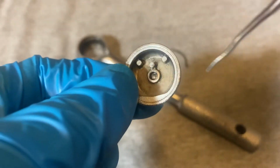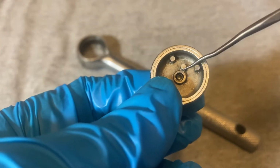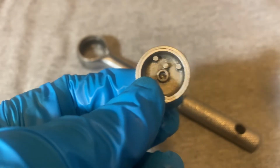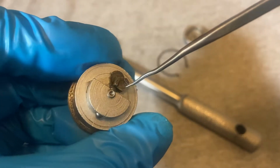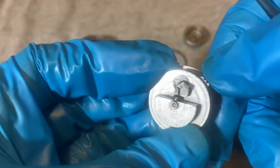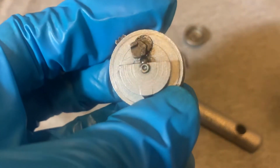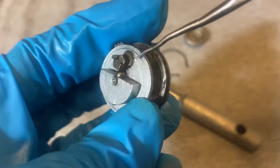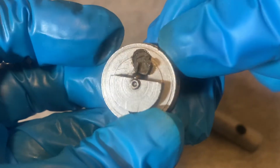There's a hole here in the middle of the switch where the protrusion fits. And here, this is what engages the pawl, the post switch combination right here. That little protrusion fits in there, and when you switch the switch from side to side, it rocks the switch from side to side, and the ball bearing underneath the little post switch keeps it in place when it's rocking back and forth.